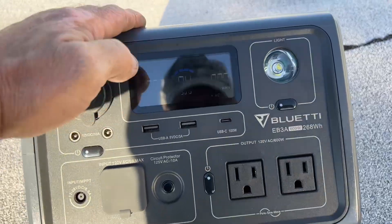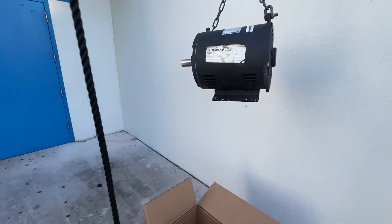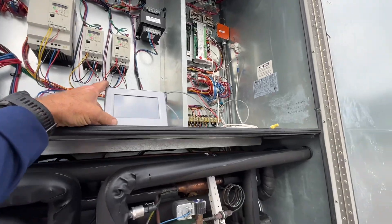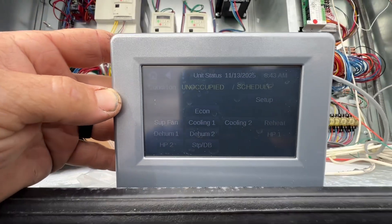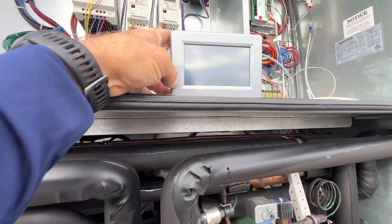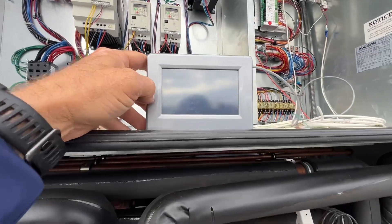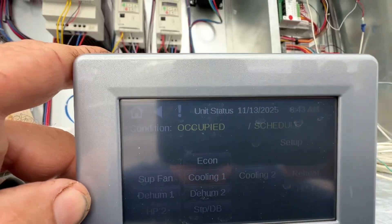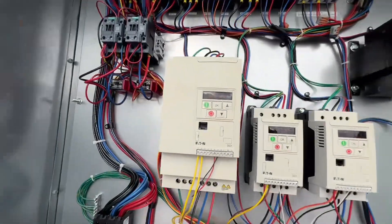Let's see how much we used here — 84 percent. So today I got a call for our Addison RTU being down. They said they tried resetting it but it just keeps going back into an alarm. Just reset it now and I'll show you what we're going off on here. No breakers are tripped, we do have full power here. The alarm it was showing was SF fail, which was supply fan failure, and my drive was showing a 1T fault. Right now it's off.